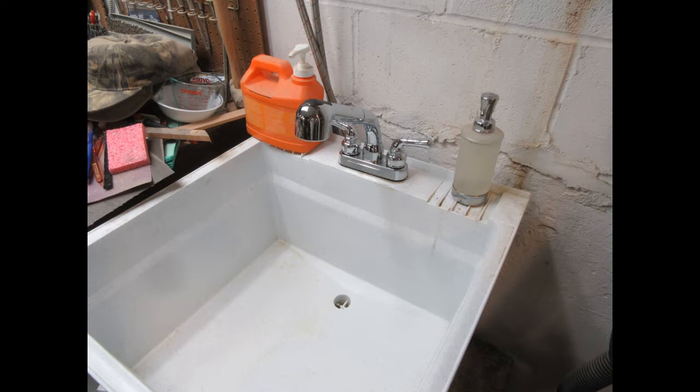Anyway, I need to move that sink periodically because it's in the way for certain things I need to do in the shop. So I set it up so the legs of the utility sink have aluminum brackets on them, and the legs were cut shorter because the sink is sitting up on a concrete pedestal. And then I can anchor into stainless steel concrete anchors with stainless steel screws. I can anchor the four legs to the concrete pedestal, but easily unscrew them to move the sink.